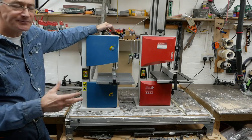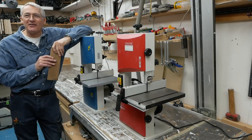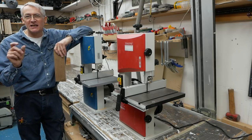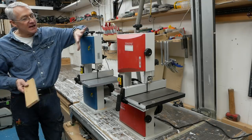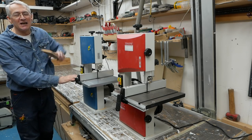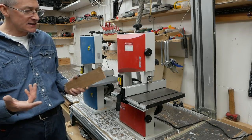The Axminster has been set up as per the manual, so let's get a little bit of wood through them and see how they cut. One of the first things I did when I got the little Aldi bandsaw was a little bit unfair — I wanted to make a really thin cut with it just to see how it handled it. About a sixteenth of an inch, a millimetre and a half or so — not quite veneer thinness but not far off — just a little piece of oak. So I've set up the same test again. Bear in mind the Aldi bandsaw is on its original blade still and it's cut all kinds of nasty things, whereas this one is brand new. Both of them have a six-tooth-per-inch blade as standard by the way.